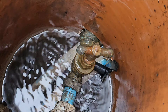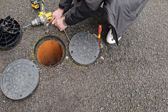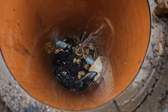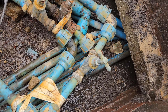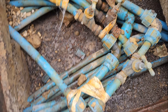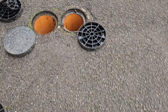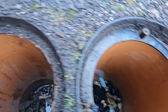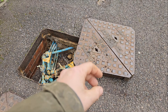Looks like we're getting somewhere — that's got to be equating to the leak. We couldn't lift this one up but I could definitely hear something down here. Will you look at that. It's never this easy — look at the state of all this. Surely it could have been done a bit neater. Because we didn't have much room and the customer didn't want us digging up the front of the flats preventing access, we managed to remove the gland nut and reseal the stopcocks. So there are no more leaks.